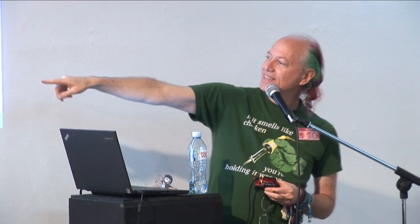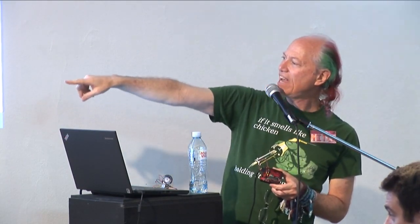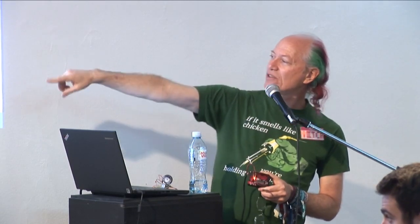Okay, and one other thing, look at this white text down here. It says binary sketch size. That's the size of our program in memory. So 1,084 bytes. Those are bytes, not gigabytes. Out of a maximum of 30,720. So that's the size of memory we have available. The memory is actually 32 kilobytes, but 2 kilobytes is already used up by something called a bootloader.